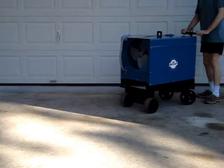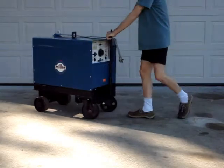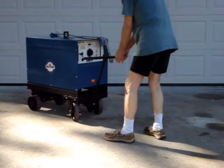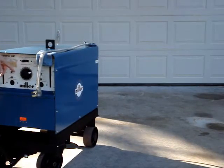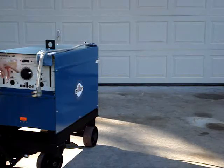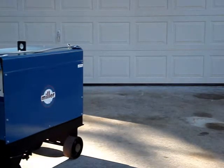It's a show-and-tell thing today — I'm making a quick movie. I also made this white pointer knob. The knob was here; the pointer was broken — it was plastic, I think. But this was made out of sixteenth-inch aluminum, held to the back of the knob with three screws. It's exactly in the right place. I don't turn this thing more than I need to — I think it wears the rheostat out. That's my personal theory, and I don't like buying rheostats unless I need to.